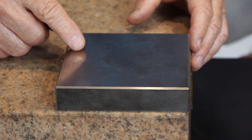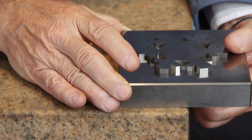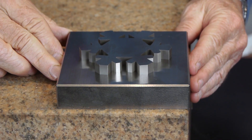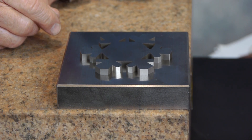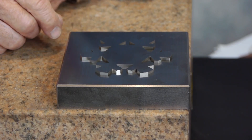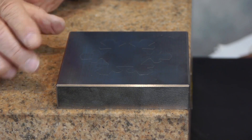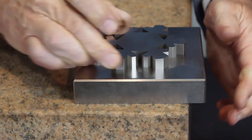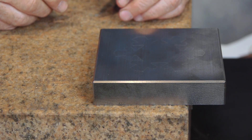Take a look at this part I'm going to demonstrate. This is a snowflake that we made — one of our display pieces. You can see the outline of the snowflake. Now I'm going to push it out. This is made out of two pieces of tool steel. Notice how slowly it goes down into this piece of tool steel. We can make it a press fit but this is a slip fit — it's just escaping air allowing this to fall down into place, right down until all the air is out. That's how precise we can cut with wire EDM.